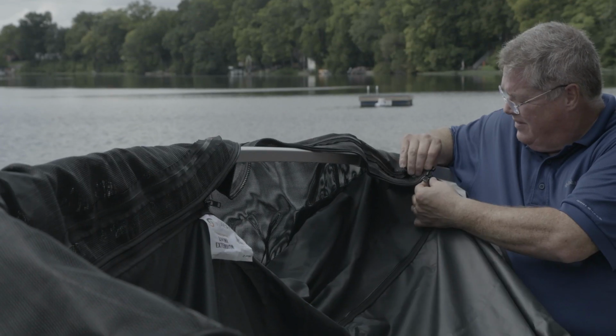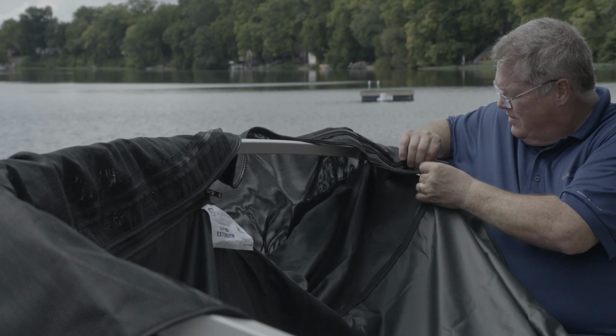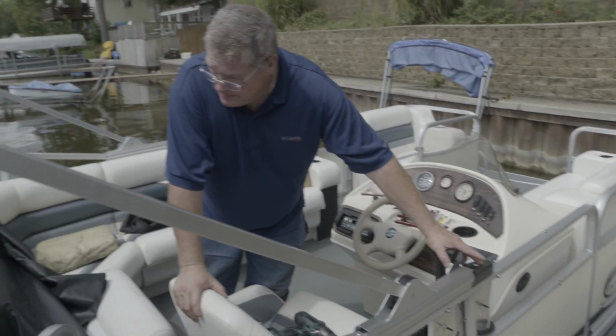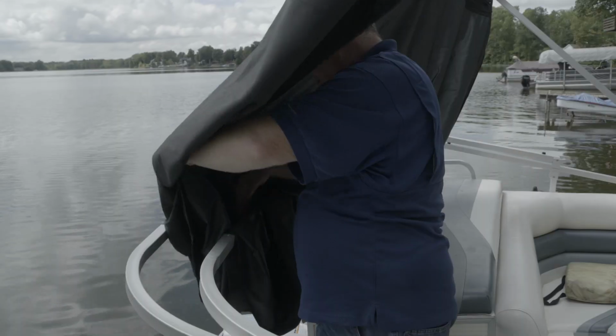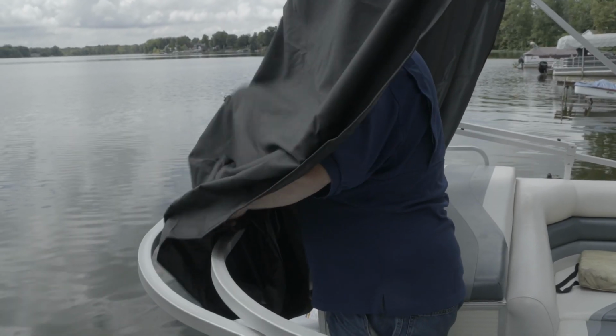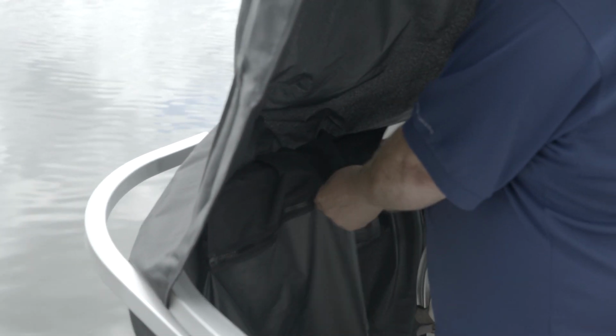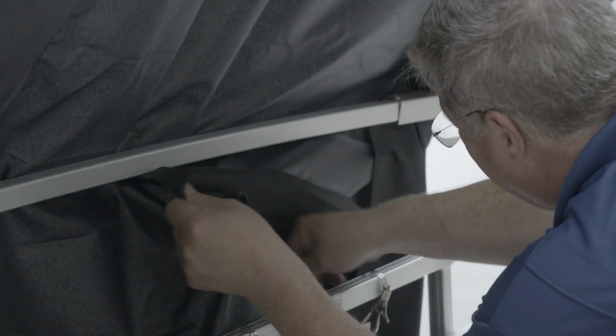The rear of the Bimini top has an access hole for a stern light. On newer canvas tops, the front of the top has a zippered storage pouch that is separate from the top's front zippered mounting pocket. If a stern light is attached to the rear frame's bow, slip the Bimini top's access hole over the light. Then, spread the top outward, aligning the rear zipped pouch over the Bimini's rear bow frame.